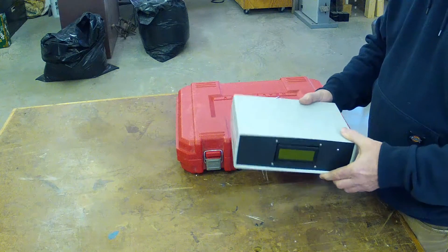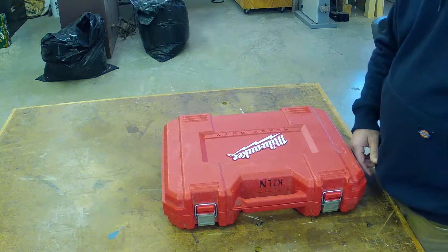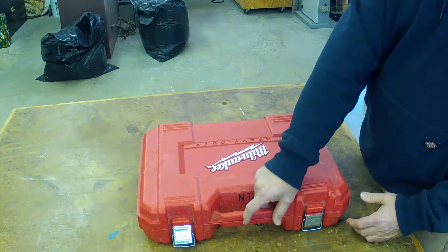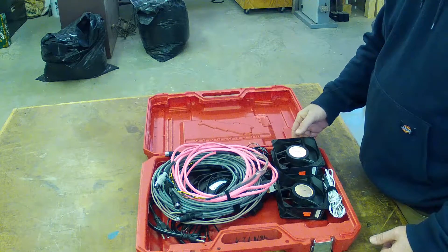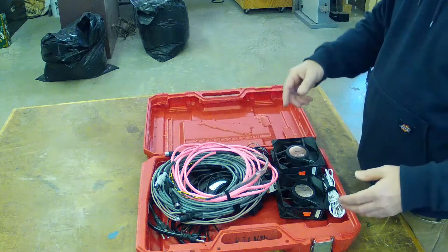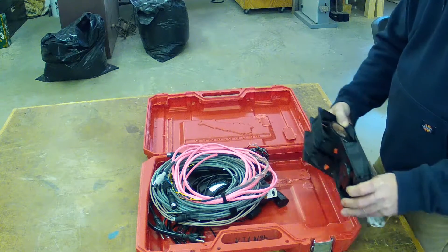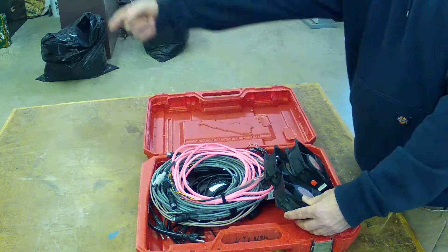This is how I boxed it up and I'll open it in a second. This old Milwaukee box I repurposed to put all the sensors in. The kiln is — call it portable — I can pick it up with the forks on my tractor and move it. It's currently in the other barn waiting for its next use. So I cut the guts out of it and this is where I put all the components. In my first video I talked about a fan at each end blowing opposite directions to sort of make a circle. I decided I wanted more air so I've added three more fans, and these sit along the front bottom of the loading door, one after the other, blowing in a circle around the length of the kiln.